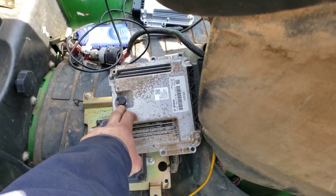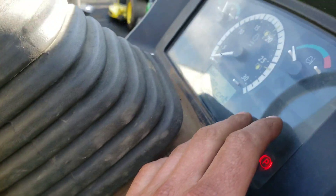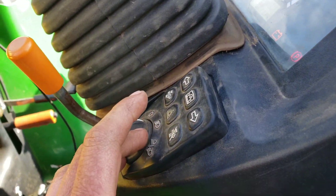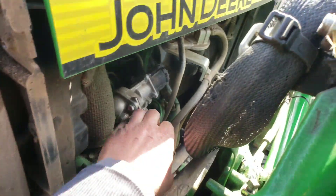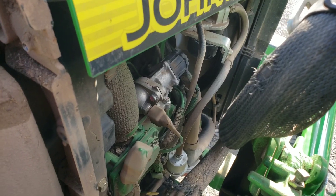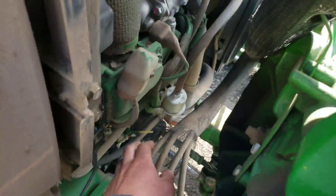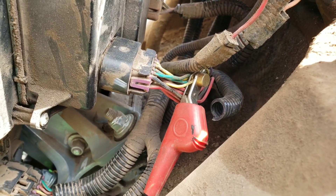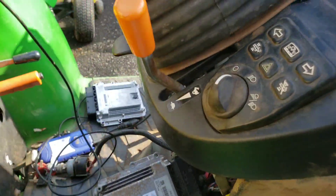We already did our power and ground checks — everything's good. Last thing we want to do is check why we're still inhibited. The only thing that will inhibit regen from occurring is either pressing this button, which will illuminate and then inhibit on the computer, or if there is a failure code within the ECU for EGR valve, air throttle, map sensor, basically any management — short of coolant temperature and a couple others — SCV valve, suction control valve. We don't have any of those. So we're right here at the ICC, our signal wire going in to see if we are shorted by any means, and we're not.